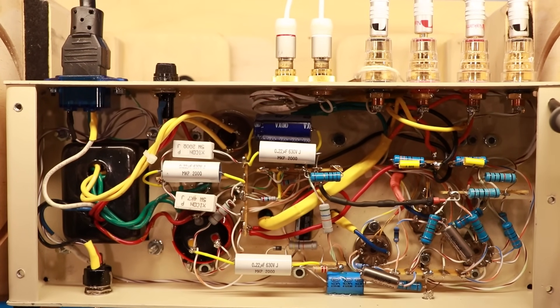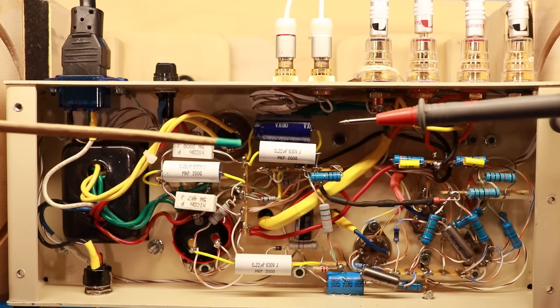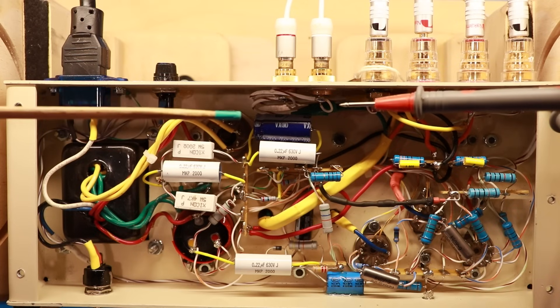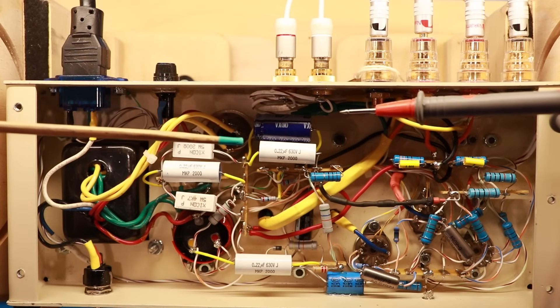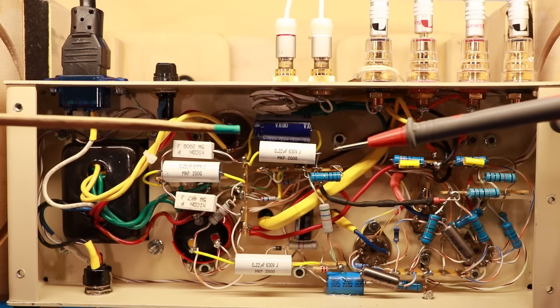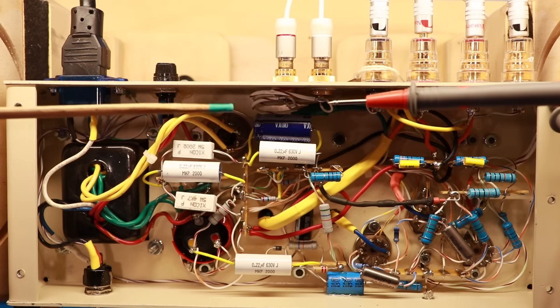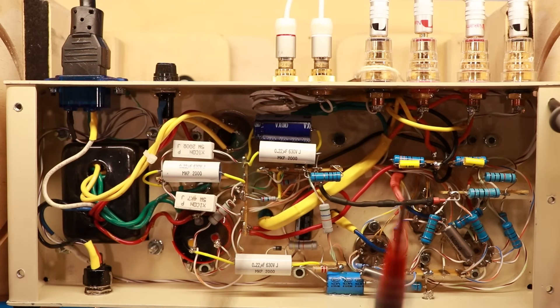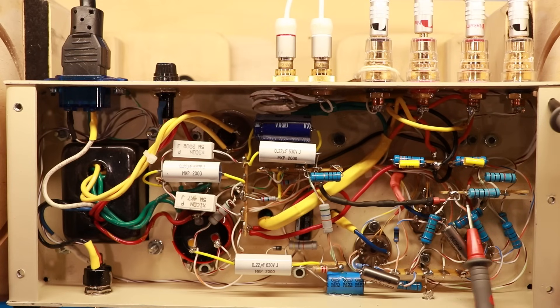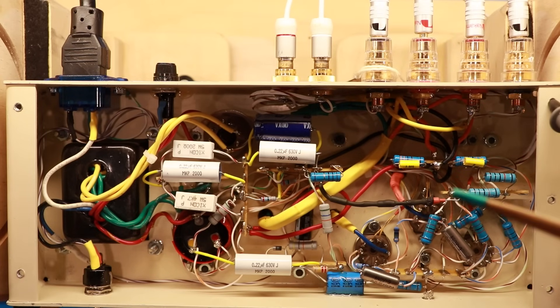I'm going to make a bold statement: these two little devices right here — I've worked on I can't even tell you how many tube amplifiers, point-to-point and circuit board, solid state electronics, receivers, stereos — and 90% of the problems I've solved, I solved with these two things. First: a plain old digital multimeter. Get a decent one — get a Fluke, spend the money. Second: a chopstick, something to probe around physically. Usually there's something out of whack voltage-wise, meaning a resistor or capacitor has failed, or you've got something loose — a cold solder joint that broke free over time.